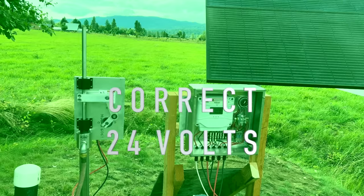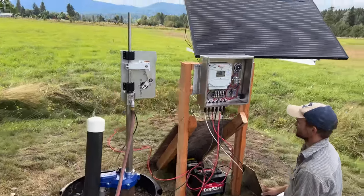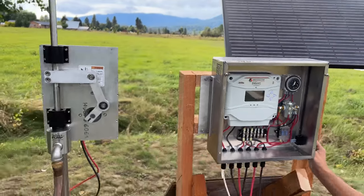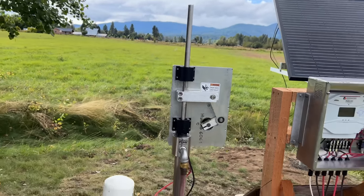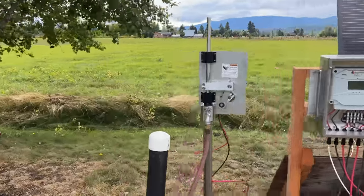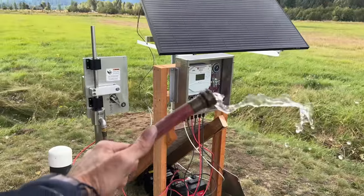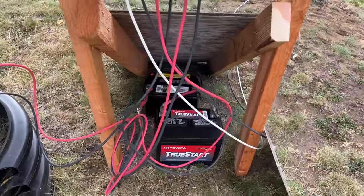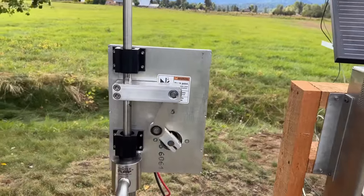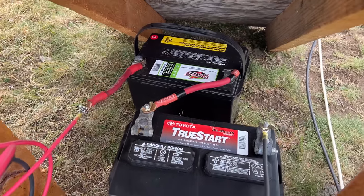All right, gentlemen, we are chooching now. Gerai just pointed out we have a green light now instead of a red one. So we are coming in with 24 volts — hit the switch. Now we're going! Look at that thing go. It's got some power to it — I'm feeling a little bit of pushback on the hose. That's fabulous. These are just old batteries we were going to recycle — they're not even good batteries. So if we get some good AGMs on here, this thing is going to be a pretty robust system. There we have it — that's how you wire 12 into 24 right there. We had it the wrong way before, but we've got it sorted out now.